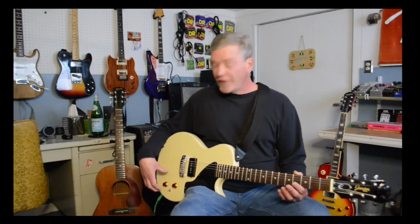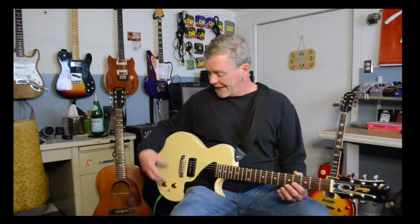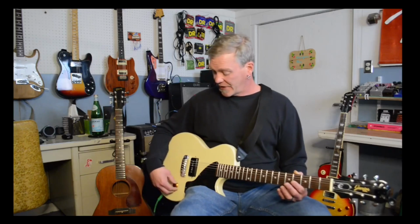The electronics are a little bit exotic on this guitar, but I used it as an experimental platform. I came up with my own circuit to see if it would work. And when I discovered that it was functional, I went ahead and drilled the holes and I put it into the guitar. And I use it for real. Having one pickup, then having the ability to go from a bright to a warm to a completely muddy sound on this pickup is fantastic. And that's not even calling into play the coil split. So when I do the boost on the pickup, I have 3 tones. And when I have the boost off, I still have 3 tonal options, all just with the flick of that little switch.